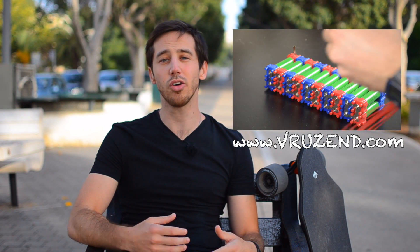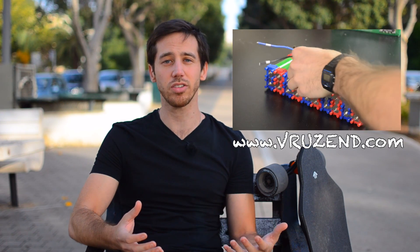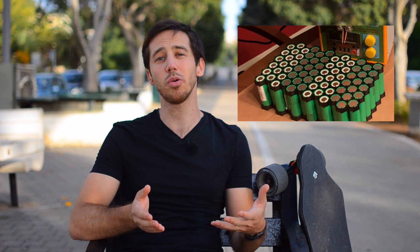The most common question was why didn't I use the Vruzen caps that I often use in battery building. You've seen me use these — they're the Vruzen caps that you put on the ends of the batteries and they snap together. You don't have to use a spot welder, you don't have to solder the cells, and it just makes building batteries very easy and simple. The one main disadvantage is that the caps add a couple millimeters on either side of the cells. If you've got a pack that's 20 cells long, that adds up and you end up with a bigger battery. For this battery, because I wanted it to fit through a hatch in the hull of the kayak, I wanted to use a different connector to make the battery as energy dense and as narrow as possible.